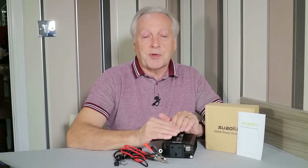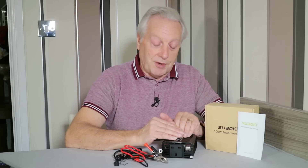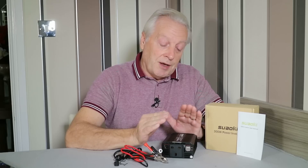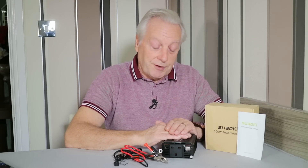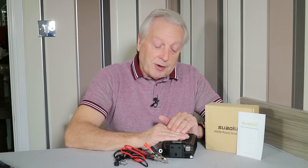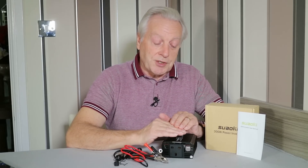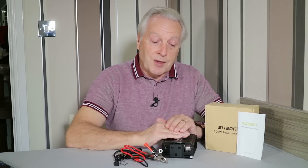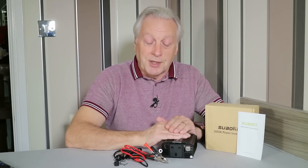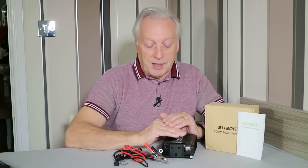The unit is fairly intelligent. If you're using this without the car alternator providing backup power to the battery, a 30 amp load is going to deplete your battery within about half an hour, so you need to have the car running if you want to use the full 300 watt rating. If using the battery alone without the alternator as backup, the device will shut down if the battery drops below 10.5 volts, preventing the battery from being too discharged so you won't have problems starting the car. Also, if it runs over 14.5 volts, the unit will shut down to prevent damage to the inverter.